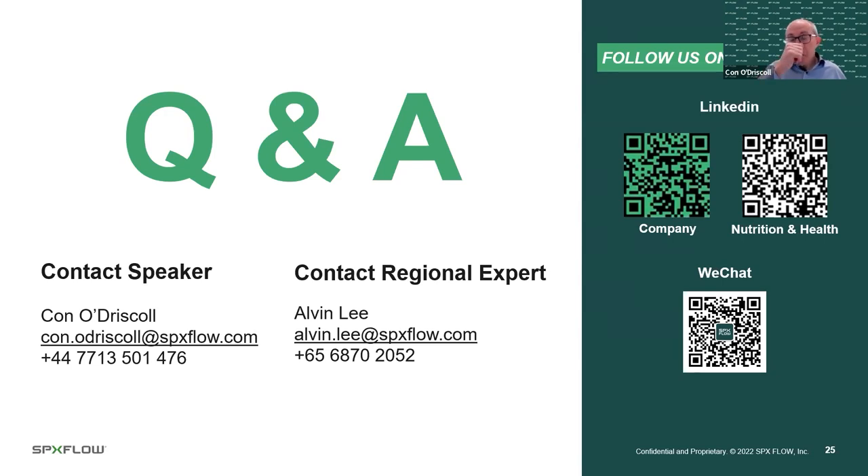On turbidity of the water output from the system: the system monitors for turbidity of up to five units — above a certain level, UV sanitation and sterilization effectiveness is impacted, so turbidity is monitored to ensure UV sterilization remains effective. Presentation materials will be sent out after the session with download links.